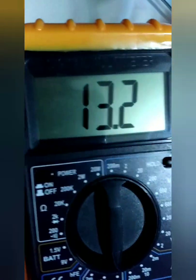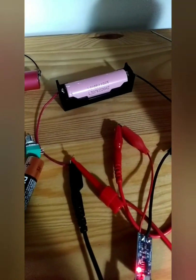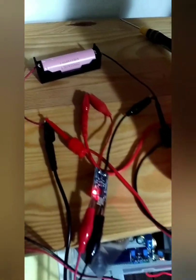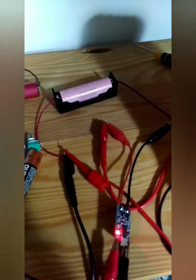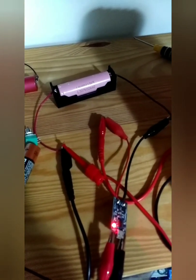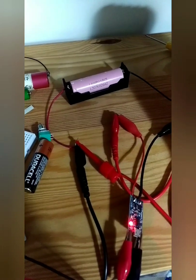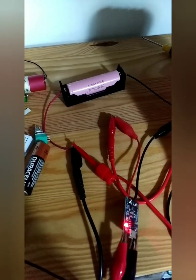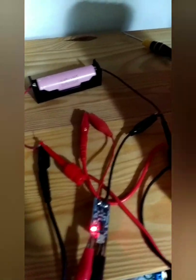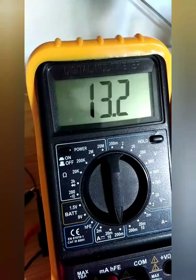Here's my lithium battery — it's a very bad cell. When I extracted it, it was at about 1 volt. I know you're not supposed to use these, but I figured if something's going to happen I'd rather destroy a bad cell than a good one. Also, these cells have lower internal resistance, so they're easier to charge. In the beginning they take a lot of charge very quickly, and that was the whole point — to see how much I could boost. The current coming in is about 13 milliamps.